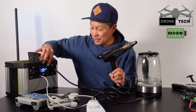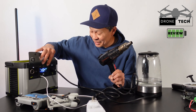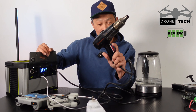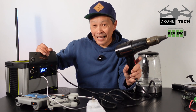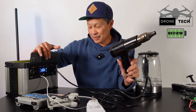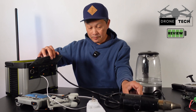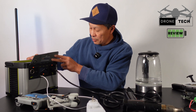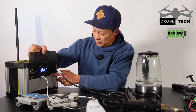At 98% full it showed 36 hours remaining, but that's going to drop fast at this load — 545 watts. Then I put it on high: 663 watts... 999 watts. As soon as it hit 1000, the red lights came on and it protected itself — very cool. To get it going again, you power off and back on, then turn the inverters on again.